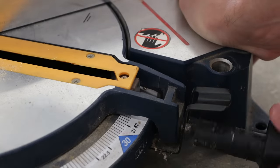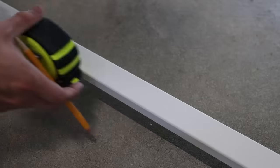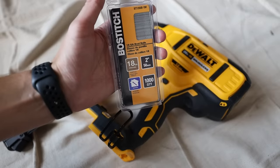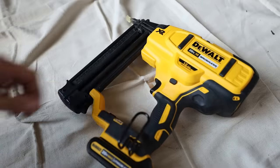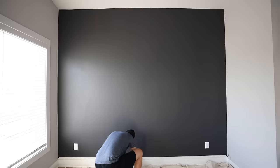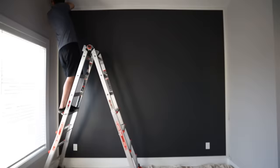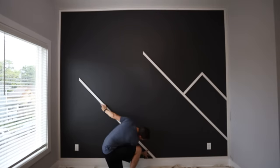To make this process easier for me, my design consisted of mainly 45-degree cuts using the windows. Most of my time was spent measuring and finding out where to correctly place the boards. There's probably a faster way of doing this, but to help me I used a speed square and laser level when possible.